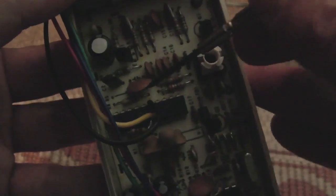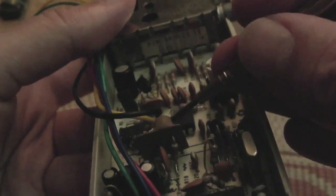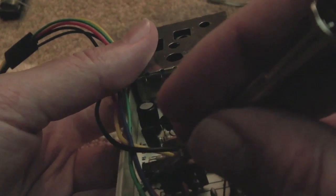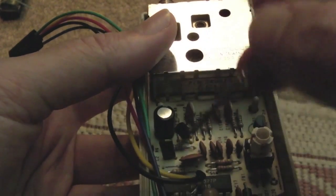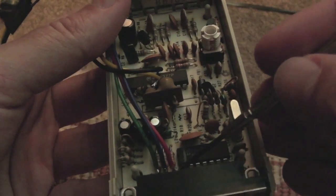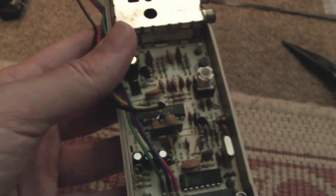Here's a quick look at the internals. I've connected a ground onto this Motorola PAL/NTSC encoder chip — it's pin 6 counting from the top left. On the bottom side, pin 2 from the notch goes through a 680-ohm resistor — that's my yellow wire going to the combined composite sync. Then there are three resistors down here, and you've got green, blue, red in that order on those three resistors, assuming you have the same revision modulator.